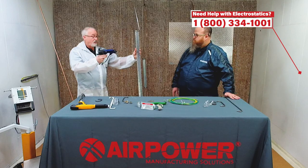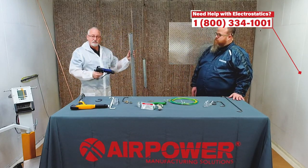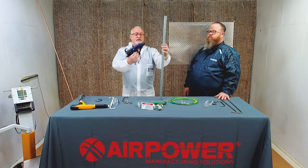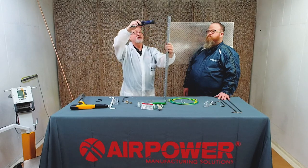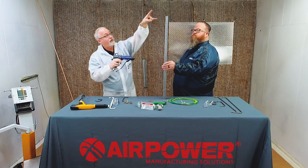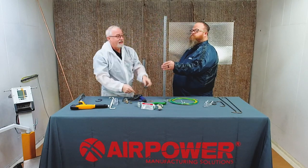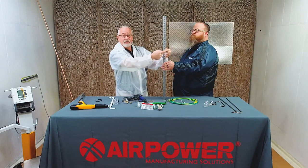So technique is really important. Travis touched on it: paint the hard areas first. Paint the corners, inside corners, and Faraday areas first, right? Paint that, then come to the back. So if you're on a part like this that has a back edge, like this, don't paint this edge and this edge. Split your pattern. Hold that, Travis. Thank you, sir. Split your pattern so that my pattern is coming down just a tad wider than the part itself, and shoot down it, and it will cover both sides and these lips at the same time.